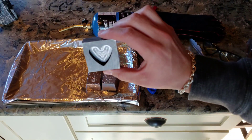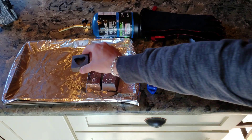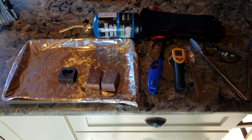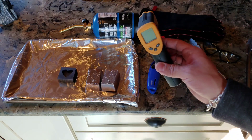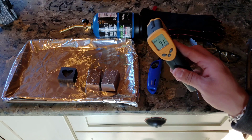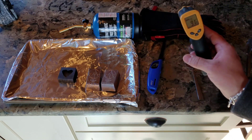I did pick up one crucible, just a basic heart, and we will have to preheat that with this propane torch. We also need a temperature gauge so we can make sure it's at least 520 degrees — that is the melting point of bismuth.